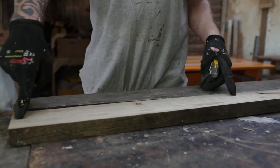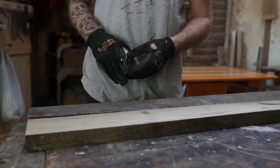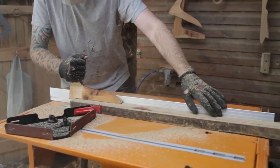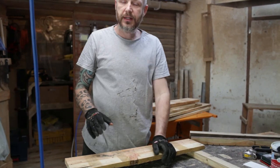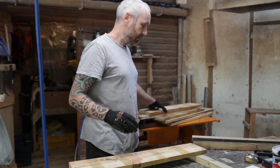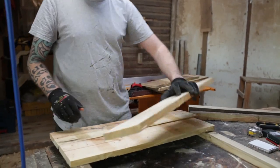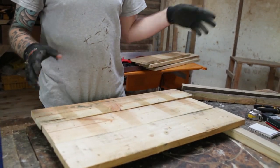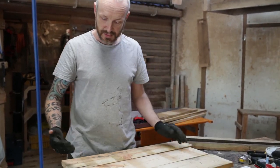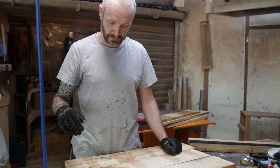So now what I'm going to do is rip cut — which means basically you run down the length of the board — these into four legs. It's about 11 centimetres wide, so about six and a half centimetres each, and I'm going to do that on the table saw. I was just speaking to Nikki about the depth she needs for her plants, because we're going to be growing seedlings in it. She reckons three pallet boards high. The width of the window is 54 centimetres, so I'm going to cut these to 54 — this is going to be the side. I'm going to make the sides first and cut an angle on the board that we'll place the window frame — the door of the greenhouse — on.